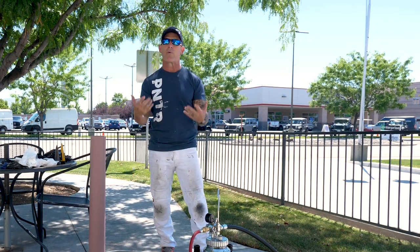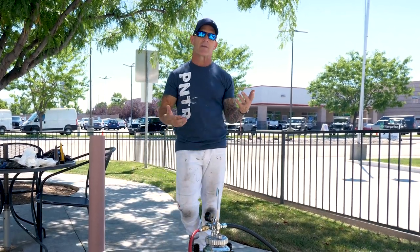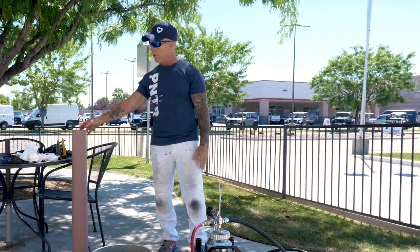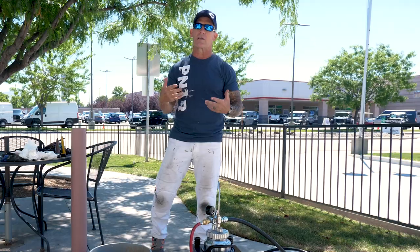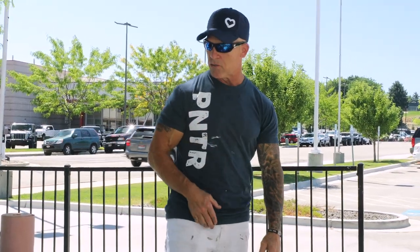They also get really rough from the oil-based overspray, and that's not a good characteristic of your drop cloth. So 4x paper, this is rosin paper. You can use rosin paper or just 4x construction paper, something that's inexpensive, that you can just roll up and throw away. I know it's an added cost to the job, but it's well worth not getting overspray all over your drop cloths.